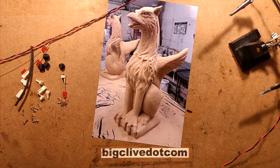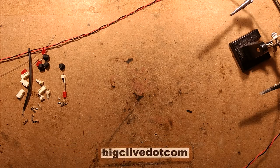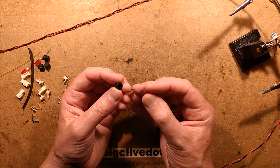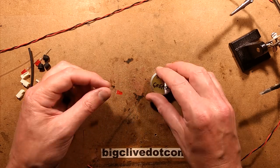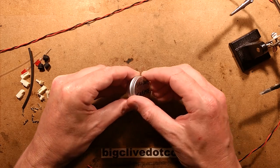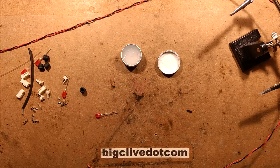Right, let's start doing this while I answer some questions. The LEDs — because this is going to be outdoors, I'm going to put a tiny blob of silicone grease at the end. I've never done it before, we'll find out when I do it. Here's the silicone grease. Let's get a screwdriver and put a blob on the back of the LED.